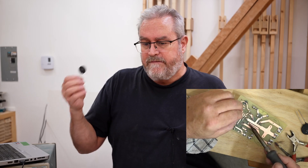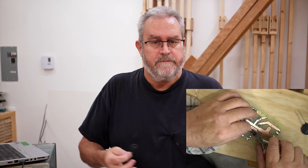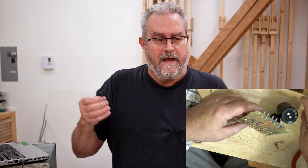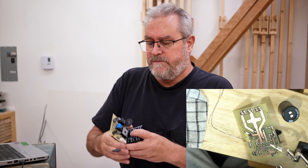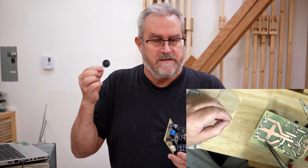When this is in circuit with the power supply, it limits the inrush current, and in doing so it heats up. As it heats up, the resistance falls. So on its own this is really all you need, but I've got some other stuff on the board here to actually bypass this after it does its work.